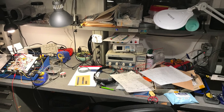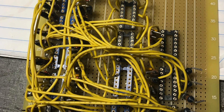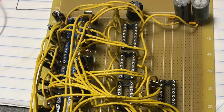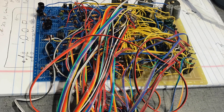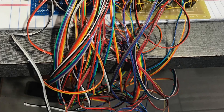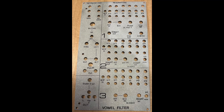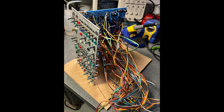So I started building it. This board is mainly the digital switching board with the capacitors and digital buffers and logic to switch the resonant frequencies. The blue board is mainly the analog board with the drivers for the different stages and the transistors. I put wires on it to connect to my front panel, then designed a panel with jacks for all the inputs and outputs to interface to my system. I drilled it out, labeled it, put it all together, and wired it up laboriously.